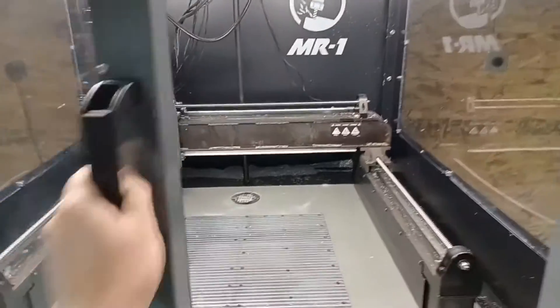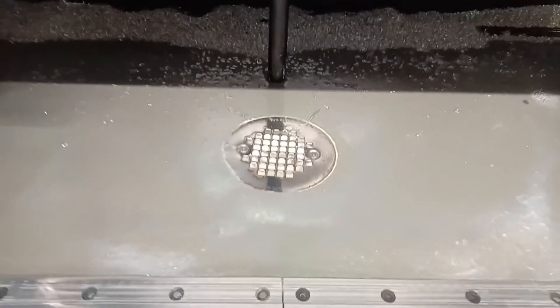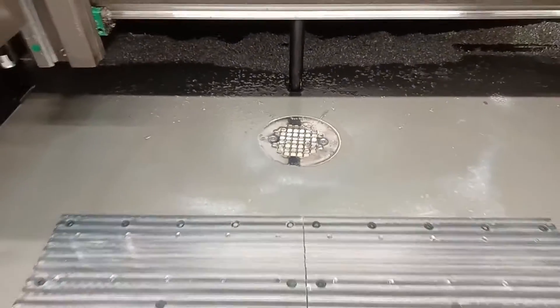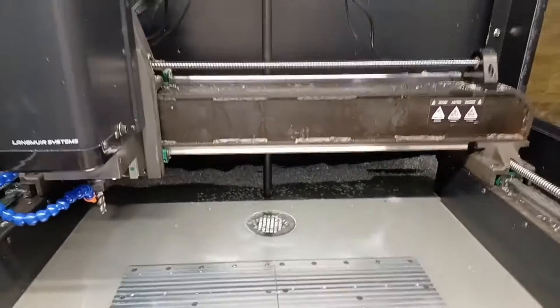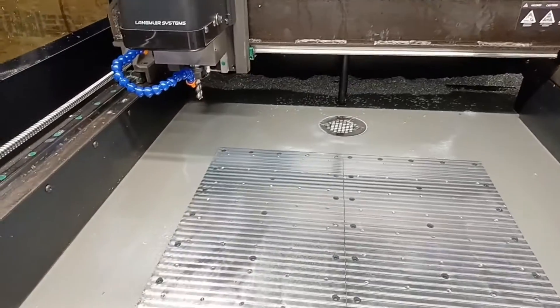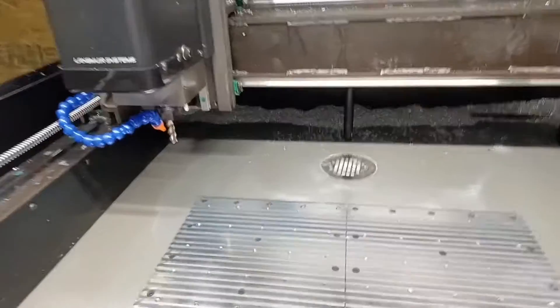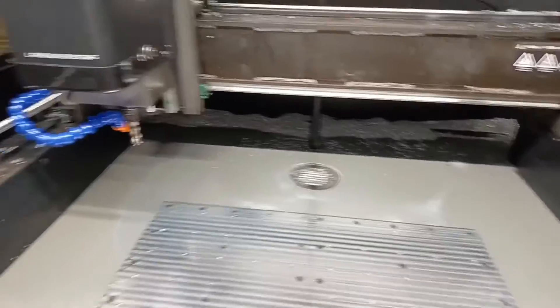What I did is very, very simple — just put a shower drain right there in the back. The easiest thing to do is to make sure that you do this before you put the epoxy, because then you'll mess your epoxy up and you might not get a good seal all the way around. I'm going to show you how that works.